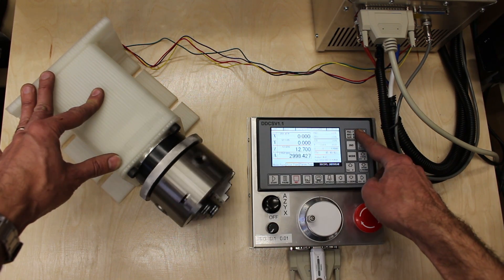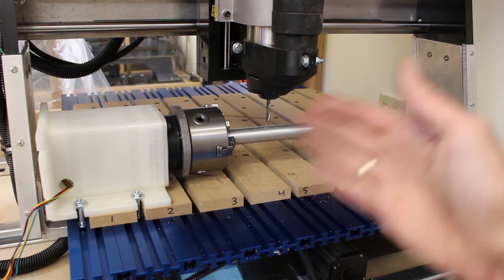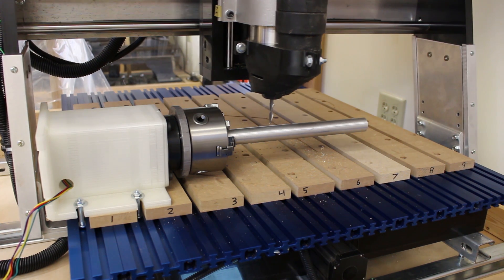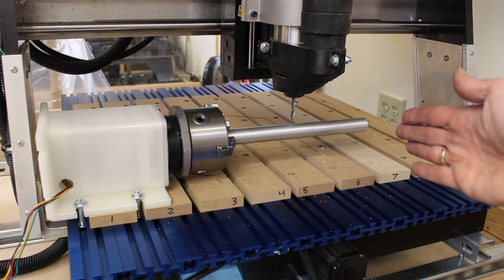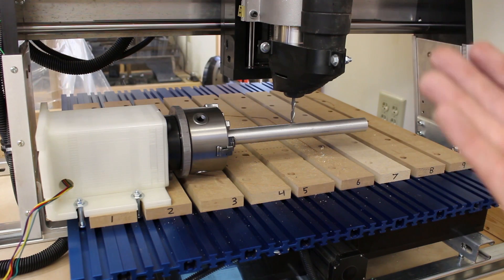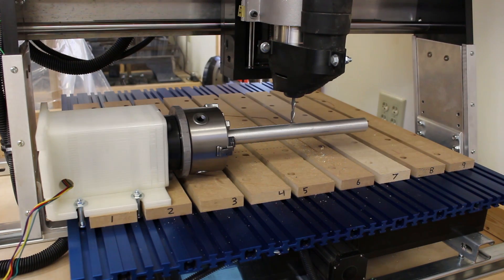The plastic enclosure is definitely not strong enough to do any real milling but it's good enough to try out and see how it's going to fit on the machines. Here's one way I can mount the fourth axis on the CNC router — it doesn't give a real large capacity but it's easier to work with than mounting in the back where you'd have to reach farther. For parts up to about a foot long this would work fine, the Y-axis has plenty of travel, and I have enough clearance on this side where the gantry doesn't hit the back of the housing.